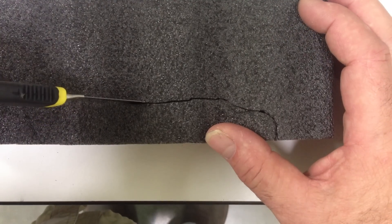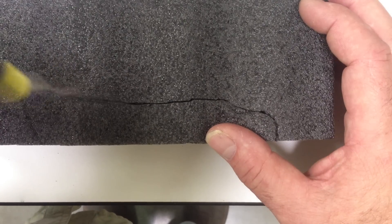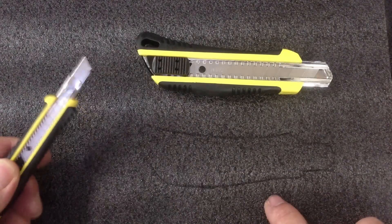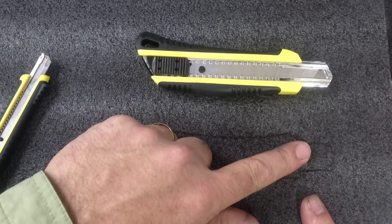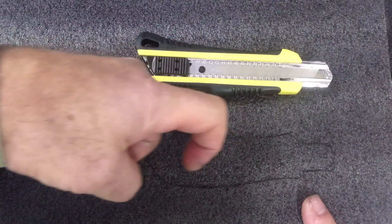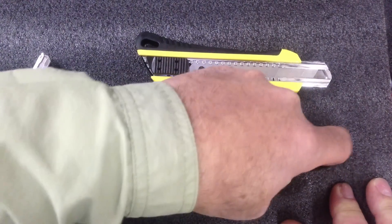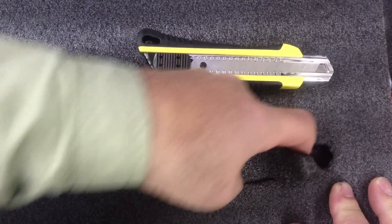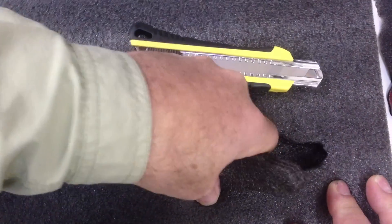You also want to make sure you cut inside the line or on the line, but not outside the line, to ensure a tight fit. After I've completed cutting, all I do is stick my finger in and begin to remove the core. The important thing to note is your finger is actually acting like a little plow — it's separating the layer as I pull it in there. I stick my finger in about the depth I need, get underneath it one layer, and just keep bringing my finger along, working along a seam.